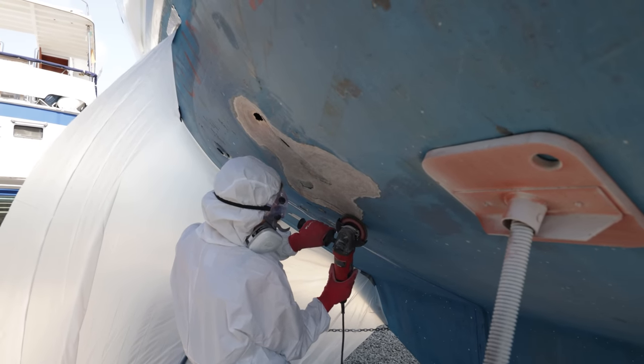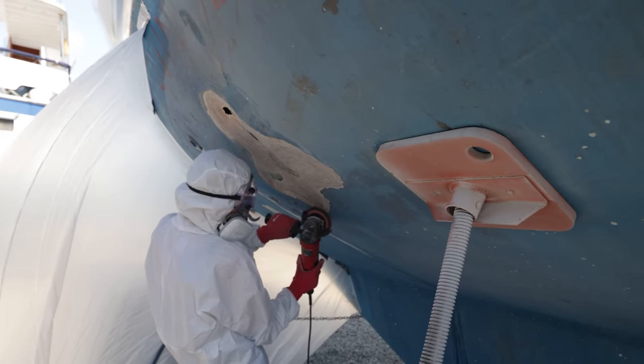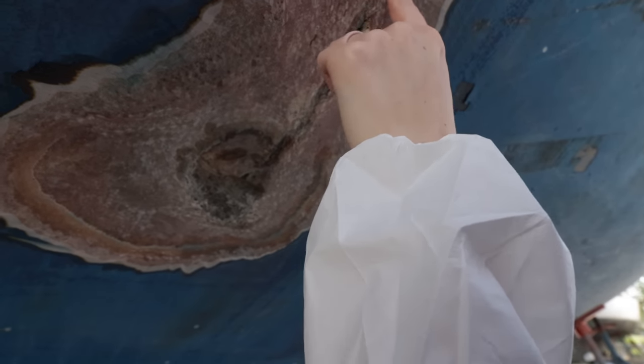So it's a new day. We're back at the boat — we've been down here for a few days now. Kirsten has been absolutely killing it with the grinder and we thought at the end of yesterday that we were done with that part. But we talked to a friend in the boatyard to get a second opinion. I took another look and I think there are a couple more spots I want to smooth out, maybe another layer that's delaminated. He said basically you do a little bit more prep work now so your job is easier later and everything goes on smoothly. The goal today is still to start laying up the new glass — that would be pretty exciting.